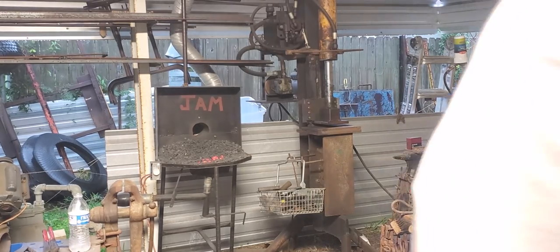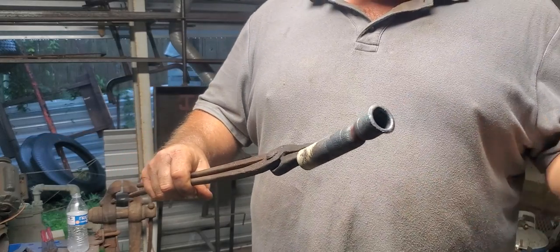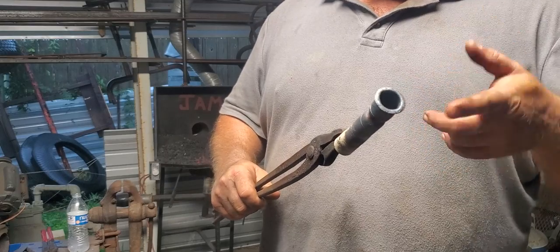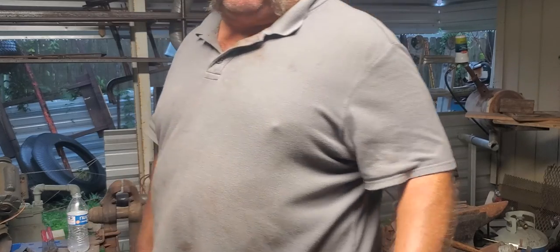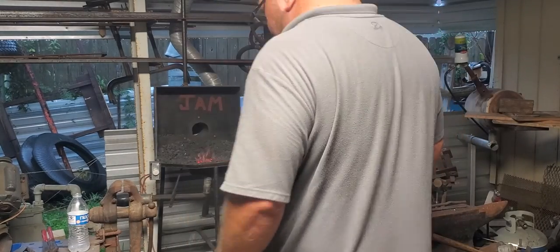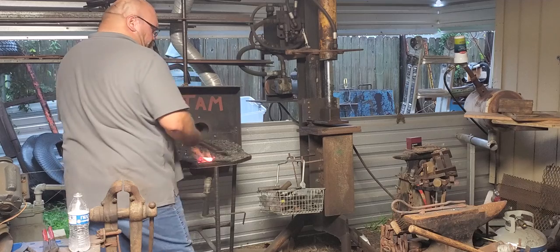So you guys are going to miss a little bit of this, but it's repetitive because I did get this one down to where I think I'm happy with it. I'm going to cut it off, maybe angle grinder, maybe bandsaw, whatever. I'm going to cut it off where it's necked down. I'm just going to weld it to the washer, or the round plate. If I was going to try to bolt it, I would go with the heavier wall pipe. If you could thread it, you could get a smaller diameter without crushing, and you can thread it or rivet it easier. But I'm gonna reach inside with the welder and just tack it on there good. I'm not that worried about it being 1/4 inch exactly, but I should try to shoot for 1/4 inch exactly. Practicing on this thin little stuff is good practice.